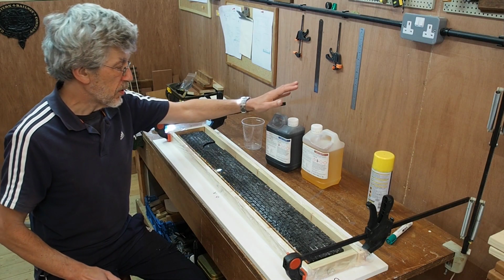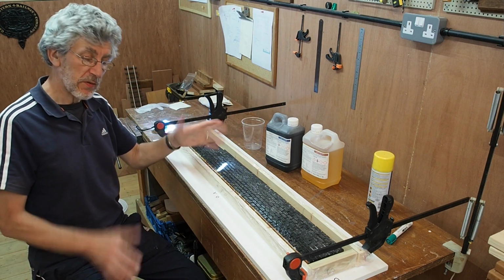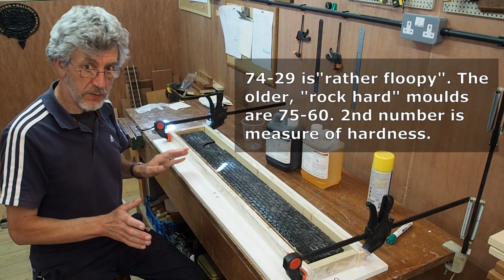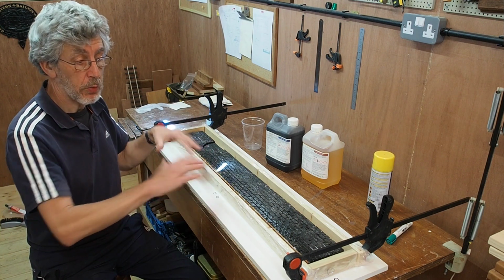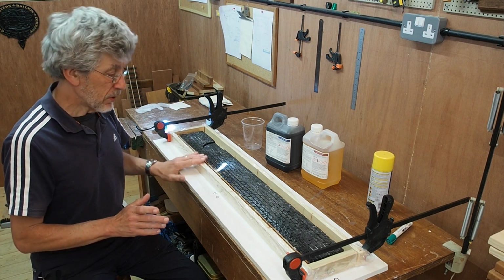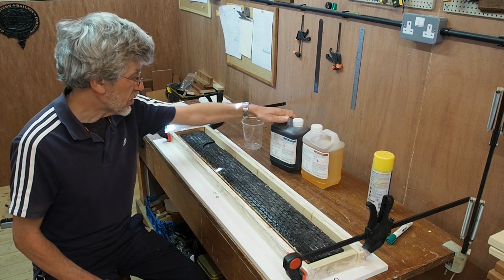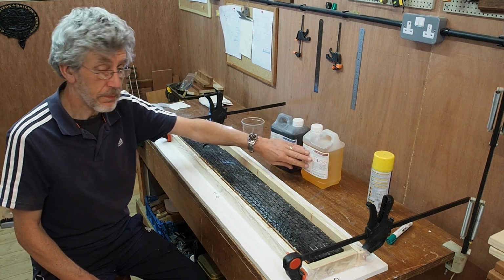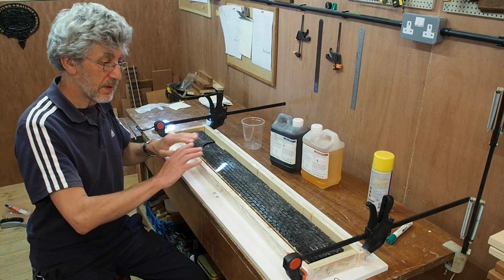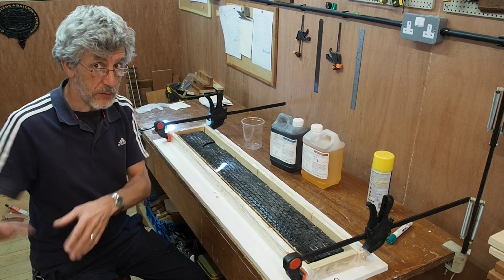The rubber that I'm using is a two-part Flexible 7429, which gives some measure apparently of its flexibility. Two-part polyurethane rubber, room temperature vulcanization, so you just mix the two together, pour it in and wait. That's my level of simple, I like that. Be conscious that this is not cheap. This combination, which is a total of probably about 4 litres, is about 60 quid. So if you're doing this whole process to save buying a 30 quid model, don't go and buy the two 30 quid models.